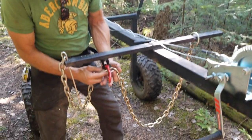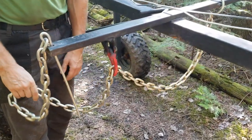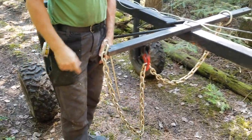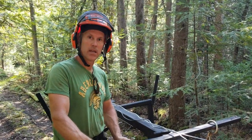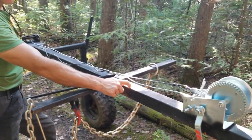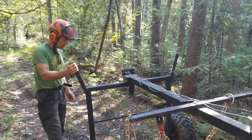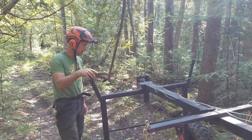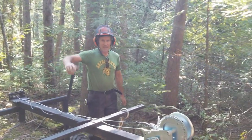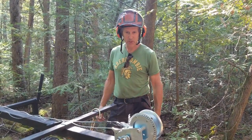I have these little cable gizmos that go on winch cables — I just welded them on so we can adjust to wherever we need, and we also use that for sticking underneath the logs. All this steel is from an old boat trailer that was given to us, so I just hacked that up and used some extra odds and ends. I welded it up with a MIG welder, and these tires and axles I picked up at Princess Auto on sale a few years ago. I'd been planning on making one of these for a long time, but we had skidders and proper equipment so I never needed to work this time of year until now.